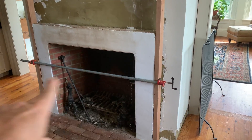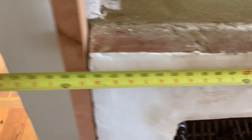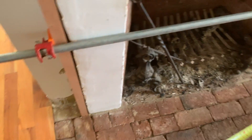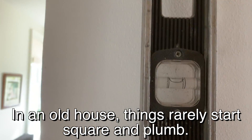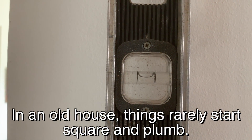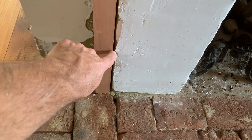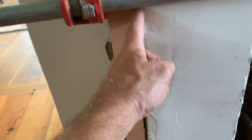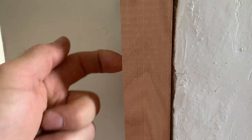I took my two verticals and just loosely clamped them in place because I wanted to see how they were going to lay. Measured outside to outside and got 60 and a quarter — and at the bottom I also got 60 and a quarter, which is amazing. They are pretty darn plumb. Now I'm going to mark where the board has good contact. It's not touching there, so I'm going to put a little shim there and one Tapcon there. I'm going to put a big shim right in the middle here because you can see it's not touching at all — Tapcon that. Then I'm getting good contact right here, Tapcon that.